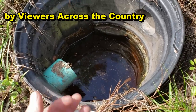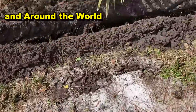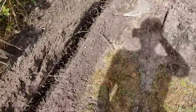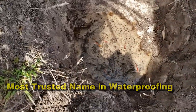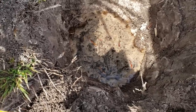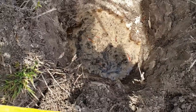We're going to go ahead and put a sump pump in here, but we're going to move this over out of the way. We started a new trench right along his property line that runs all the way down. We're going to put a sump basin right here and send that out to the front, out to the street. Even as we started to dig, you see all that groundwater. The sump pump is really important if you have a low spot. The dry well works and it doesn't — when groundwater fills up, so does your dry well and water has no place to go.